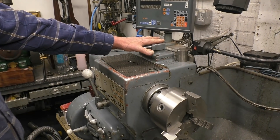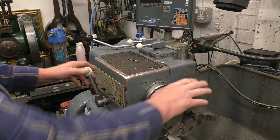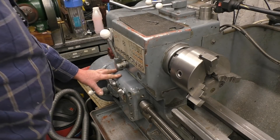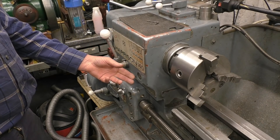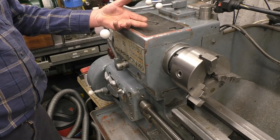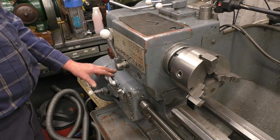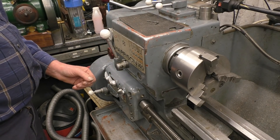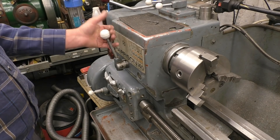The headstock on this machine has levers for changing different gears to vary the speed of the spindle — there's a high and low range on there. It's also got a clutch so you can disengage the drive but leave the motor running. Down here it's got a gearbox. The gearbox controls the ratio that the spindle turns compared to that lead screw there — that screw is used for screw cutting. It's engaged on the carriage, and as the spindle turns, that turns at a ratio so you can cut threads. That lever controls the rotation of the lead screw forwards or backwards. This lathe also has a forward/backward switch, and it's got a two-speed motor with a high range and low range.